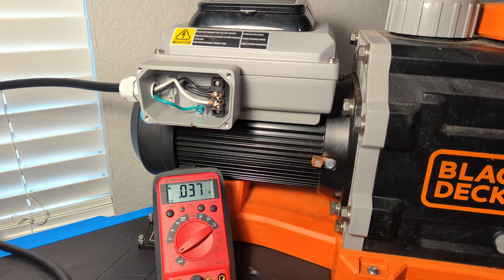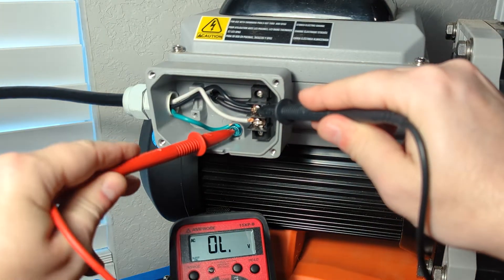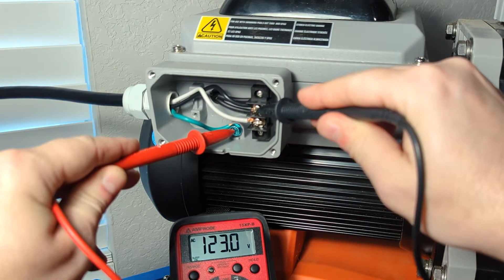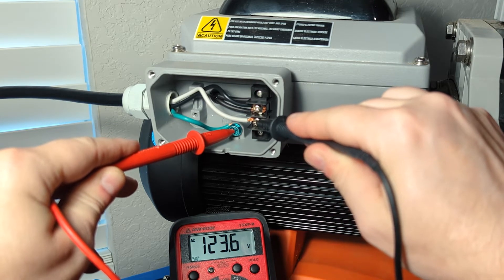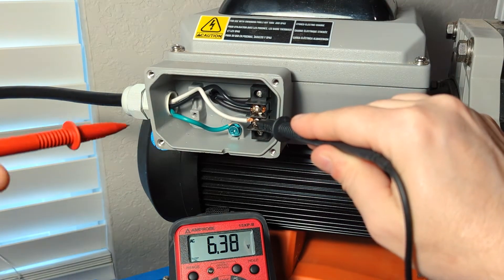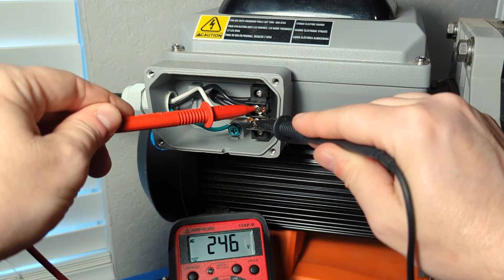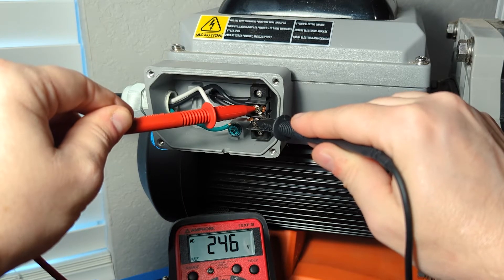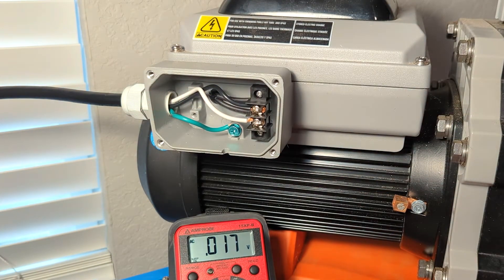They don't really test for what the voltage actually is. So with these pumps that run off 220 to 240 volts, meaning we have two lines that come in and each line carries power — you see we have 123 volts on one line, 123 volts on the other — and with the way 240-volt works, whenever we test across those two lines, we get 246 volts. We get the summation of the voltage carried on both of those two lines.